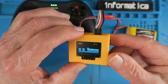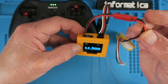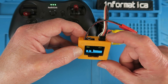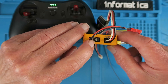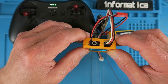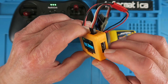Looking over the device, it's clearly 3D printed — looks like something I might have built myself, but I didn't. Power is supplied here; in this case you can use a 2S to 4S pack to power the device, or you can power it from the SBUS or PPM input. There's a little jack on the back for connecting to things like the output of a transmitter that only supports PPM, and it recommends not connecting anything else when that is in use. The only other thing is a tiny recessed button on the side.